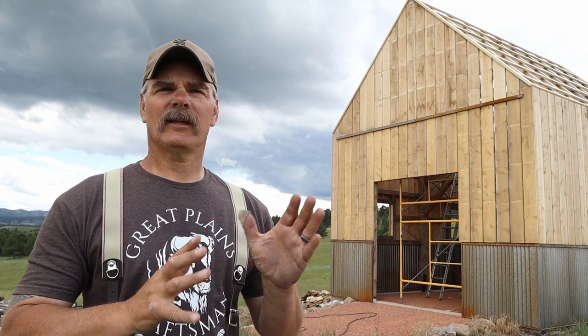As you can see, as I was putting that up, because I redid the roof structure and how those purlins overlap and those end 2x6s on the gable ends, it ties it in nicely, and it's going to make a much cleaner transition to the steel roof. And as soon as I get the battens on at least the eaves, then I can start putting on the steel roof, I think. I've got to get the steel roof on. It's not going to quit raining.